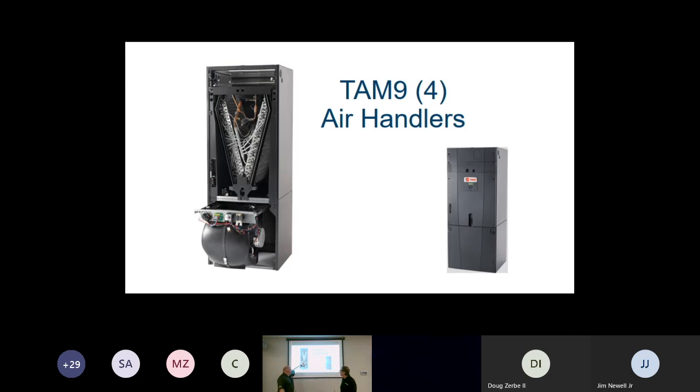The one thing that changes is if you do go horizontal, we do recommend putting the screw here on the coil so that coil is held in place in that V shape rather than just starting to sag depending on which side you put it on. It'll make getting the door on and off a lot easier, because I can tell you, most guys that are laying on their side with a flashlight in their mouth, with their phone, are griping to me about these doors. They're the worst thing to ever put on. I can't stand it. Who designed this? Well, do you have a screw in the coil? No. Put a screw in that coil now. Right. Oh my word, it goes on, it doesn't fight me to line it up. Right. Because realistically, you're getting the door on and you're trying to lift the coil, the stress of the coil, with the door.